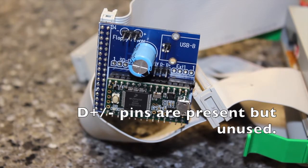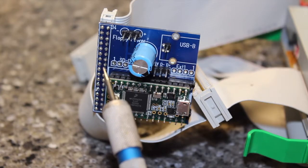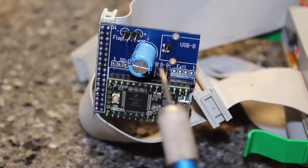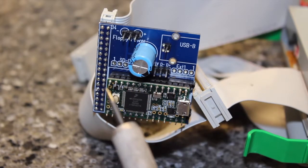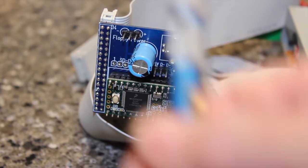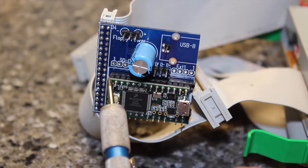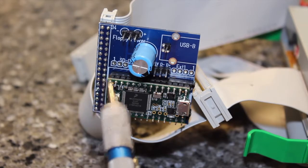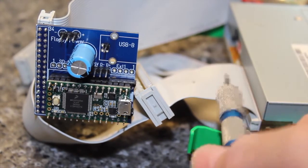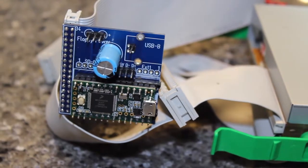In summary, all you need to make this board work is the Teensy on it and a connection to the floppy. I like this method because rows of header pins are super cheap, you can plug a cable into it, and you can box the whole thing up — just have your power supply wires from USB coming in and output to floppy. You could 3D print a floppy box or just lay it on something insulating. I didn't like the hard port output because it results in clearance issues with certain kinds of floppy drives, and it's easier and cheaper to plug a cable in.